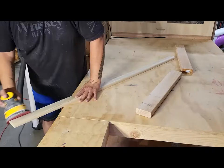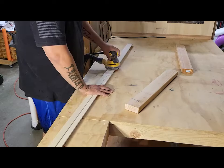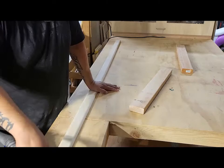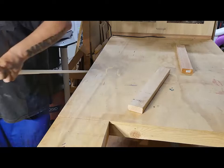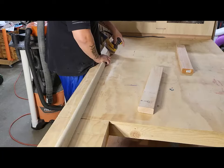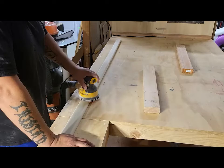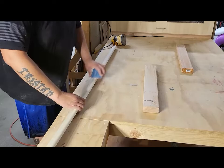Then it was time for everyone's favorite part of woodworking — sanding. About an hour of my life I'll never get back. Like most things I sand, I use the orbital sander when I can, but I usually like to do one final pass by hand to make sure I got everything, especially on something that might get touched a lot or will be painted. There are little nuances you can feel by hand that you can't feel with a power sander — there's a sanding tip for you.